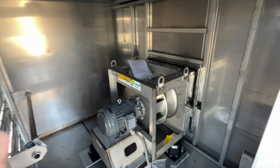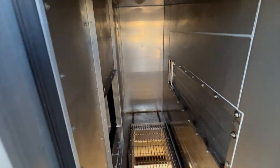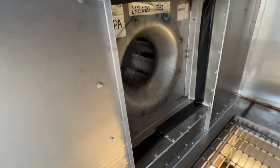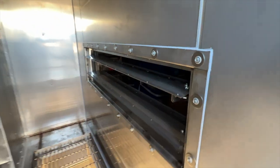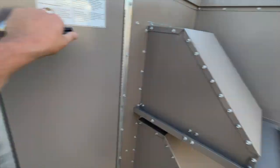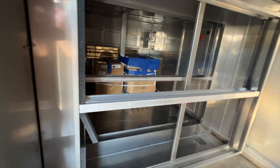This motor spins the fan, which forces air through the unit. Behind door number two, you'll see where the hot air and steam gets sucked in from below and pushed through the damper here — this is a damper that is controlled automatically. Behind door number three, we have the filter housings. Filters will go there and stop particles from heading inside the building.